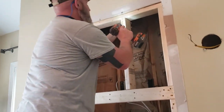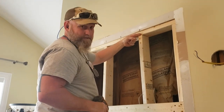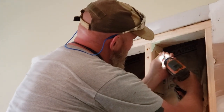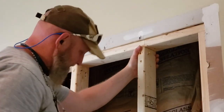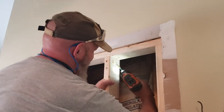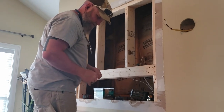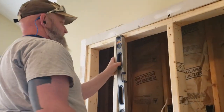I put it up here and left it a little bit tall on the edge. It pulls it back. I didn't run it all the way in so it wouldn't pull it too far back. Now I'm looking at my line and I can run that one in. Stop shy from pulling because I don't want to pull the board back. Now because this doesn't fit, if I go at a little bit of an angle like that, it comes out. That works for me. If you have to move it over, don't leave your level on it. The level is a precision-type instrument and I see a lot of people beat the heck out of them.